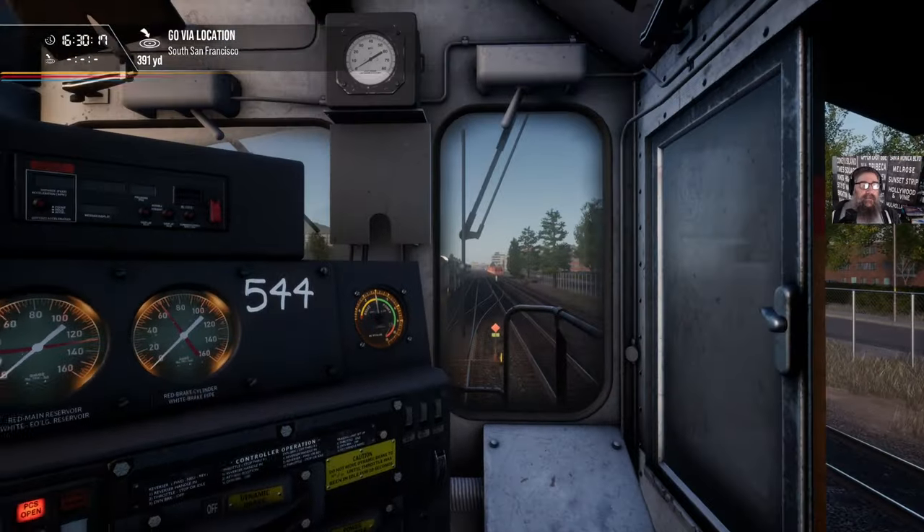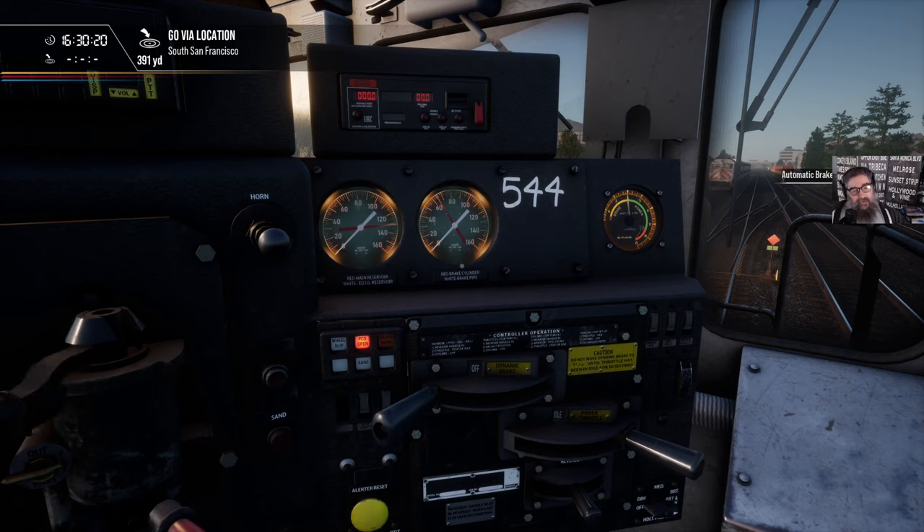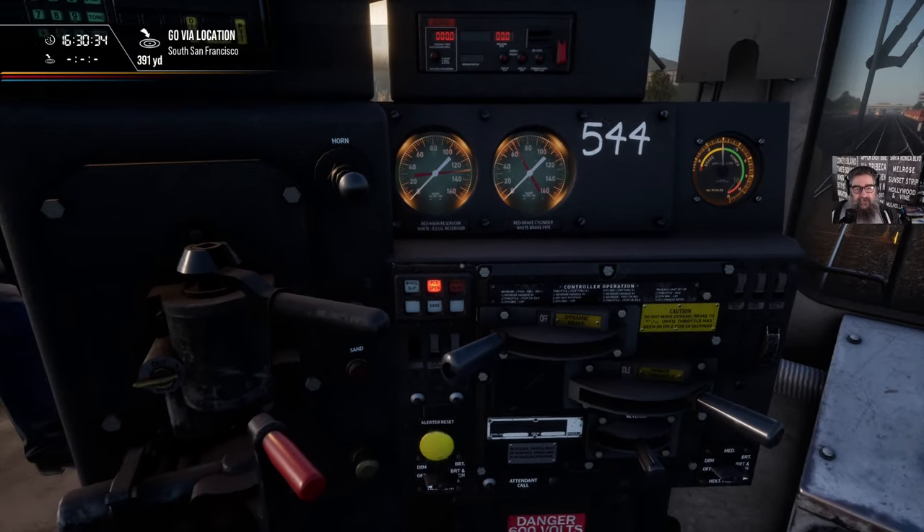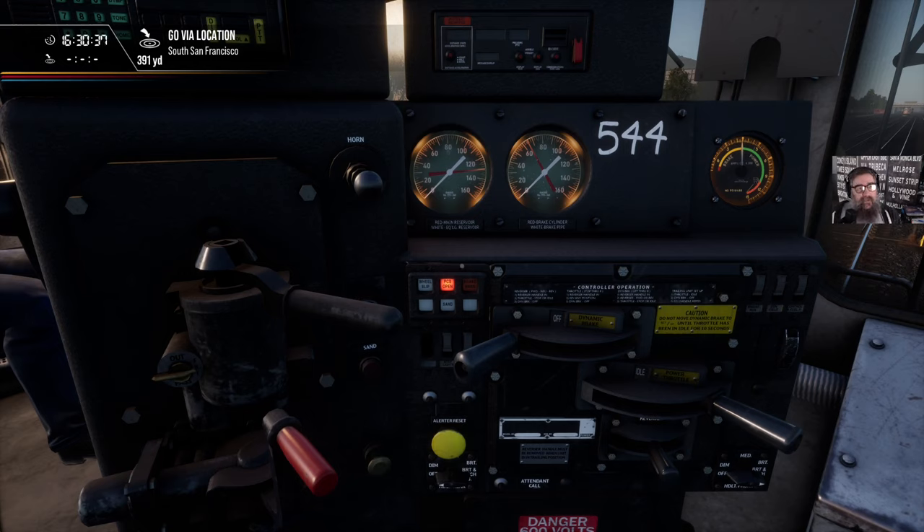Coming back to the chair, you'll notice the PCS light is on. We have to put the brake handle into emergency, verify that our reverser is in the neutral position — and it is — and that our throttle is in idle — which it is. Now we have to sit here for a minute waiting for a timer to elapse. At about 31:20 we'll be ready and able to release it out of emergency. Note that some trains want you to put it into suppression, some into full service, and some into emergency for the duration of the minute — so research your locomotive and do whatever's appropriate for yours. Some make you wait the full minute, some don't.